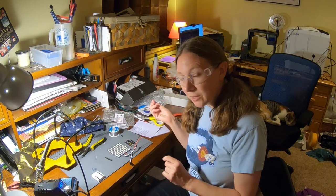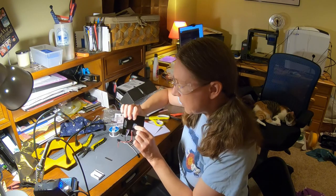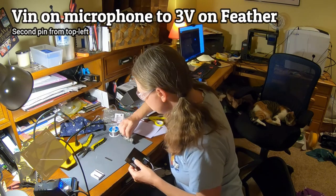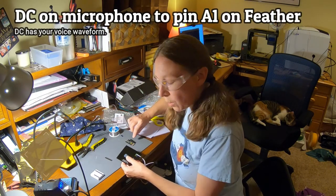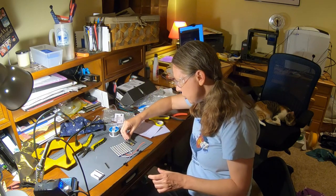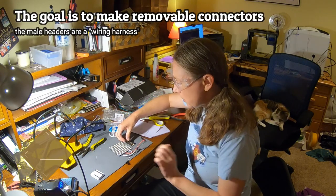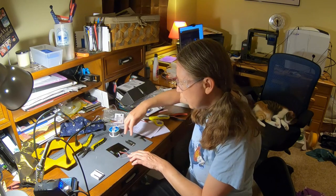The other wires you don't need — just unsolder them from the matrix. The microphone is going to mount to the back of the matrix. For the microphone wiring, we'll use three wires: V-in, ground, and DC. V-in goes to 3V on the feather, ground goes to the correct ground pin, and DC goes to pin A1. We'll take a length of male headers, cut them to match the pins on the feather, solder to the pins we need, and have removable headers. I'll pause while I do that soldering, unsolder the wires I don't need from the matrix, then solder the wires to their correct connections on the feather.